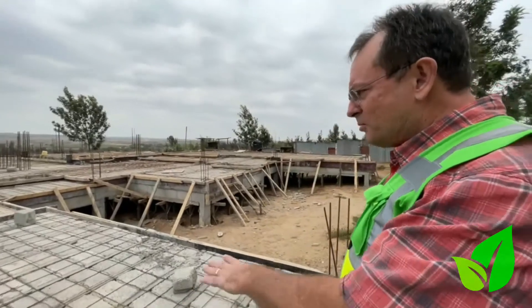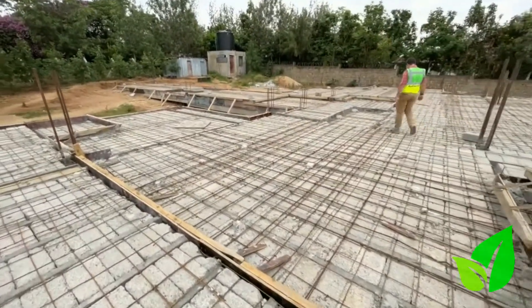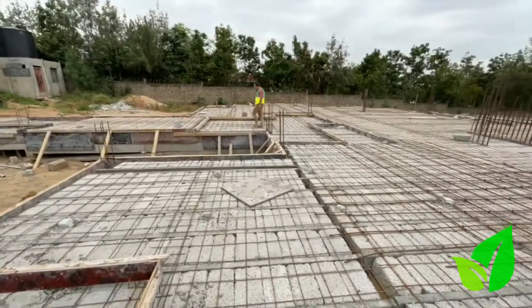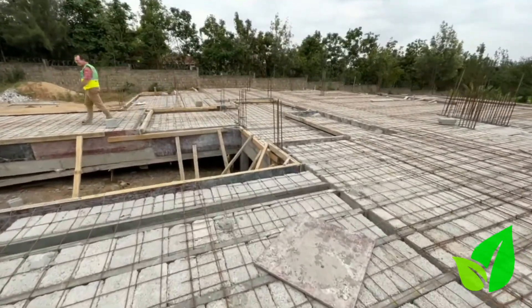What they've done here is they've put BRC on top. This is not typical for our floors but it's one way of doing it. Normally we would just ask for a sand cement screed, but the engineer here has opted for BRC reinforcement.